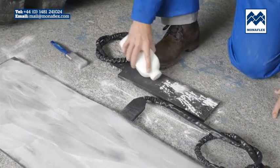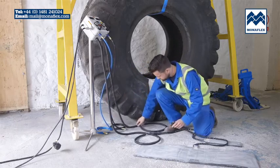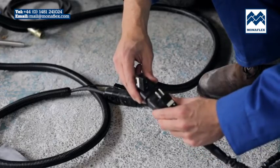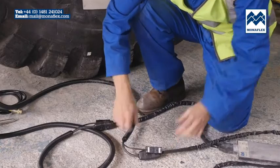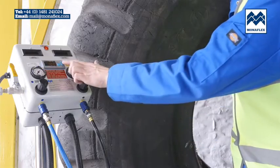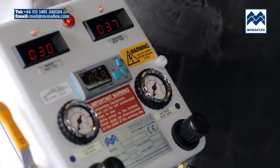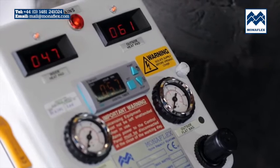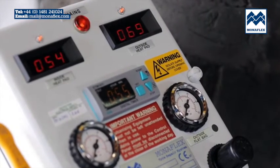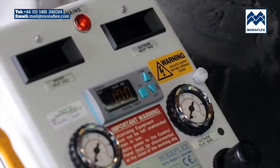Before use, it's recommended that both heat pads are preheated to approximately 50 degrees centigrade or 122 degrees Fahrenheit to increase flexibility and aid installation on the tire. Connect the wraparound heat pad X-Lab WH to the left control lead and the bead heat pad X-Lab 1H to the right control lead. To preheat, power up the control panel and hold down the start button on the timer. The displays will illuminate and show the current temperature. Wait for both heat pads to reach between 50 and 70 degrees centigrade, then press and hold the stop button on the timer.